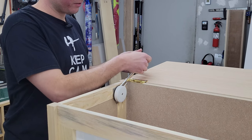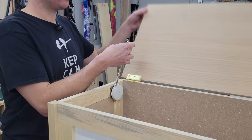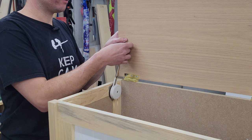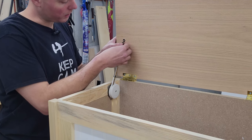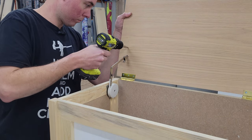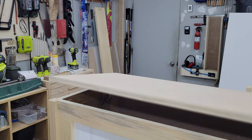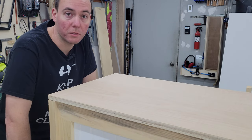I'm just going to get it in the ballpark area and then adjust it so we have nice solid wood to screw into, also avoiding going through the panels in the middle. With this side mounted I'll lift the lid up — it is hard to move because of the soft close — extend the lid to 90 degrees or right about where I want it, drill the holes and attach it. I'm going to add another one to the other side and the lid is done.